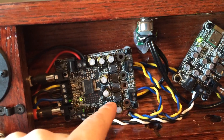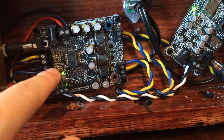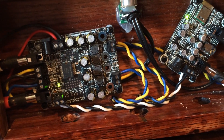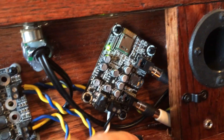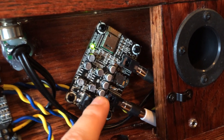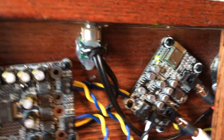If you remove the back panel you'll see the rest of the inside. There's the amplifier, which is a Sure 2-by-15-watt. These are 8-ohm speakers, so it really only gives about 8 watts per channel. You could upgrade to a heavier duty amplifier if you want — these speakers will take about 30 watts continuous — but I didn't really find the need to, especially going Bluetooth. There's also a Sure Bluetooth device hooked up to a potentiometer, which is the volume control up here that lets you turn the volume up and down. The crossovers are internal so you won't see them.